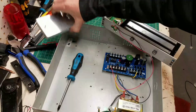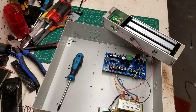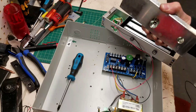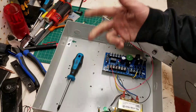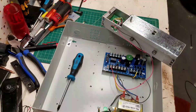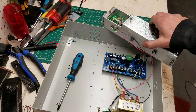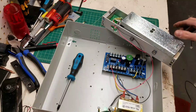What it does is, when the door closes and you go through that door, it closes and this magnet turns on, and 1,200 pounds of force goes onto this chunk of steel and will not let you open the door unless you have a key card, a handprint scanner, key fobs, all kinds of stuff like that. Whatever grants you access to that door will drop the maglock and let you through. As soon as the door closes, the maglock engages again.